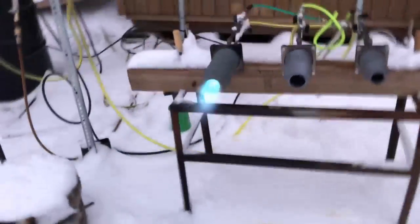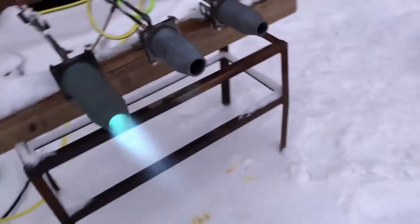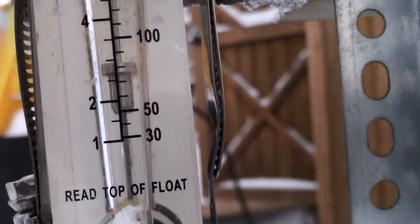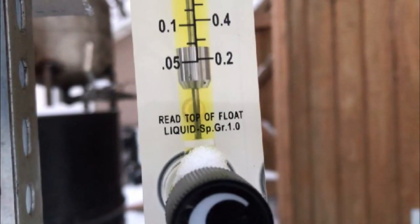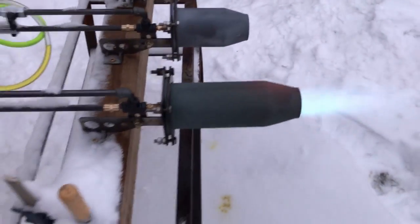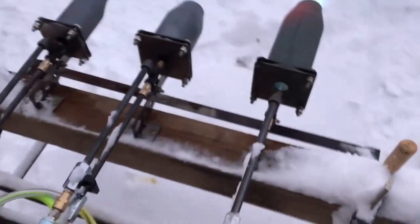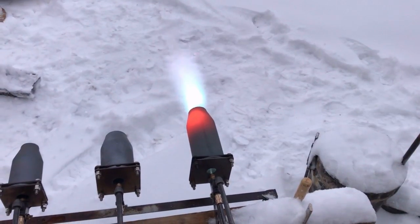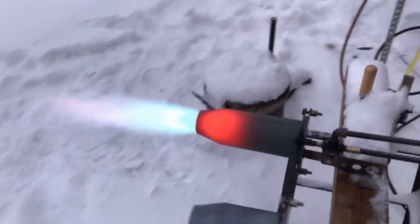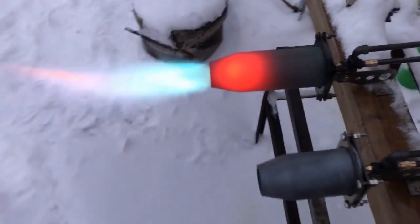Here is the largest one. It doesn't have the good high fire flame characteristics, but look how white hot the inside of this thing burns. We're at about 85 liters a minute, and that is about 150 kilowatts. This one is more of a radiant heat type of burner — it really starts to kick off some IR. You can feel it standing next to the thing. Got a real nice flame to it.